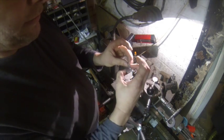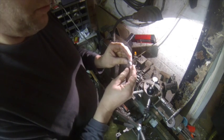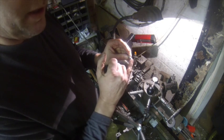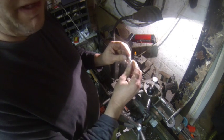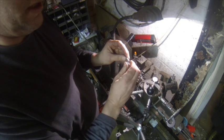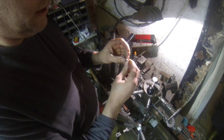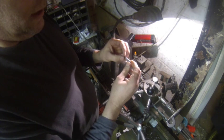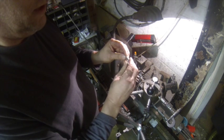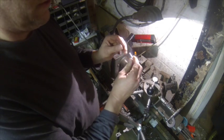This fits into a collet and everything is turned true to that diameter. The big problem with pin knocks is holding the small pin diameter — it has a tolerance of about five to six tenths of a thousandth of an inch. If they're undersized, the pin knock doesn't grip right, and we found that if they go over 128 thousandths, the pin knock has a tendency to crack. So our ideal is around 127.5 thousandths of an inch.